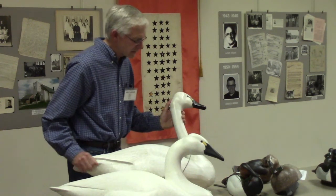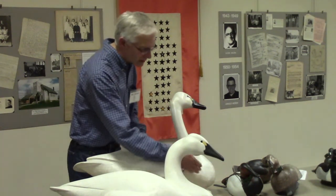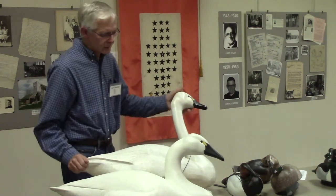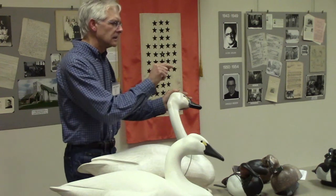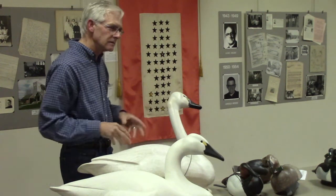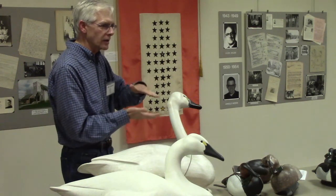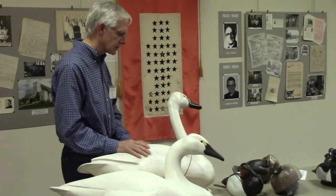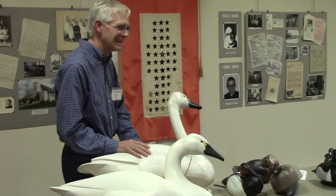And then I gauged where each one of my layers would be, and cut them out. And then before I put them together, I turned them into just rings. I cut out the middle. So when I laminated together, I was just laminating donuts together. So I'm sure I got at least one duck decoy out of my donut scraps.